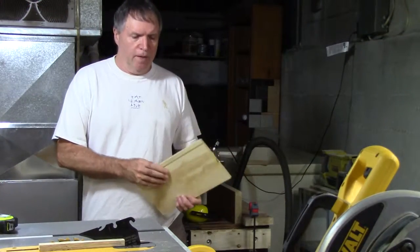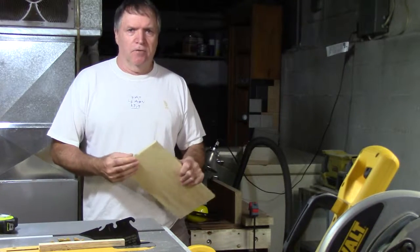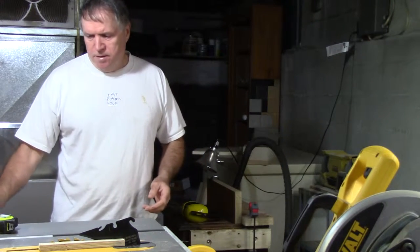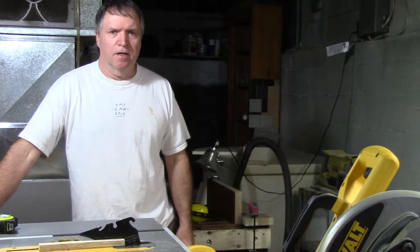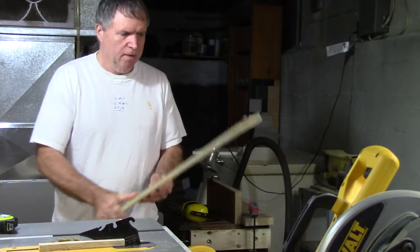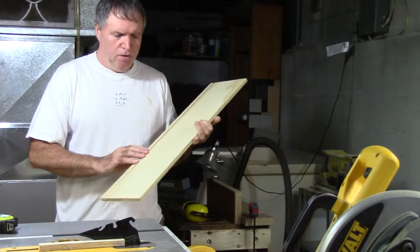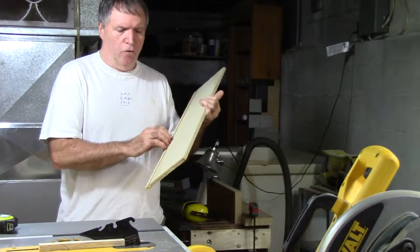Back down in my basement making the drawers for the chest of drawers. I took the side panels and the dust frames upstairs and got everything together — I'll take the camera up there and show you. Right now what I'm doing is putting a quarter-inch dado in all the sides of the drawers so that I can put a quarter-inch panel in for the drawer bottom.